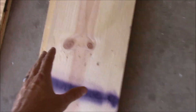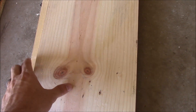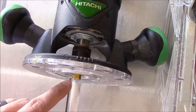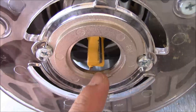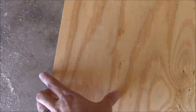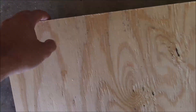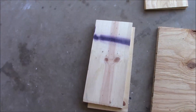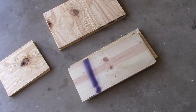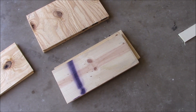The next thing I'm going to do is cut a groove in the side pieces for the shelf, using a router with a specific bit. I set it at a quarter-inch depth with a half-inch bit, which will allow the shelf — made from this plywood — to sit into the groove. You could just nail the shelf in from the sides, but the groove gives it more stability and strength. I can glue it in and it'll be good to go.